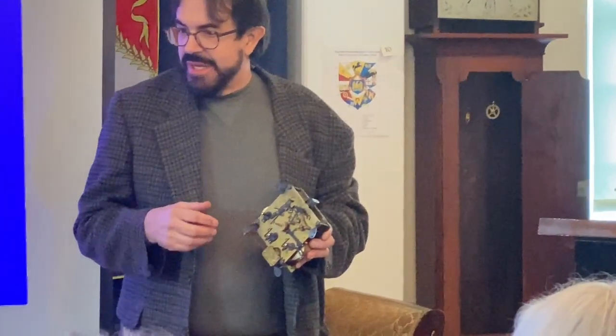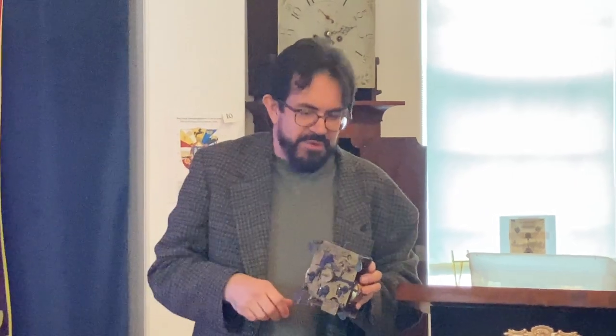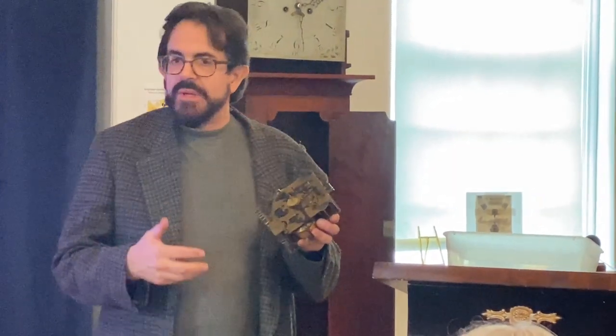And WD-40 is great in the beginning. A lot of clockmakers do that too. They'll come into your house and say, ma'am, you may smell something. And they get the can, they spray it and it stinks for a while. The clock may loosen up, it may not. The problem is, after about 6 months, that WD-40 congeals. It just shrinks down and becomes a sludge, just like the grease. So there's no guarantee for your clock because it's an old clock. If I can get it going, here's your bill, and that's how they handle it.